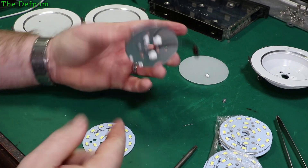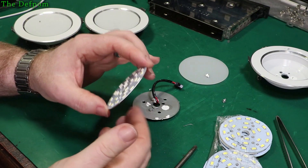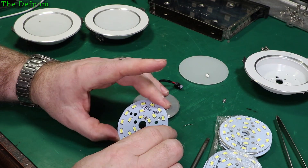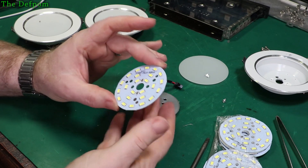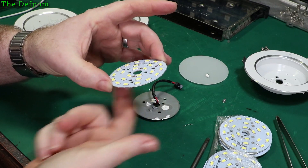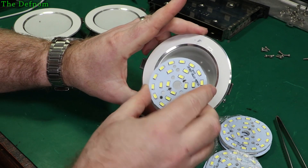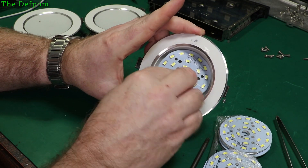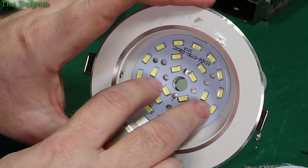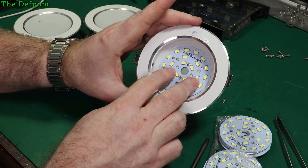Let's get the wires off this, put them on this one, and then mount that unit in there. Now what I did with one of the lights once is I actually put some thermal stuff in there - squirted it through the back to try and preserve it. I put some standoffs on it, some spacers, so it was all even. This housing is actually a little bit small for these - they actually don't sit flat, there's actually a gap. So they can't dissipate heat through the back of the housing, which is a bit of a design flaw.